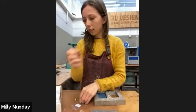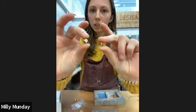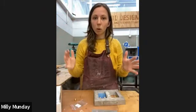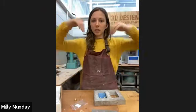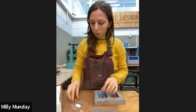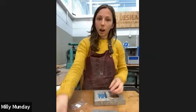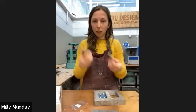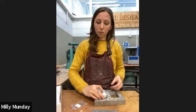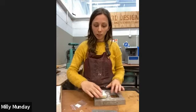And then what we've got is these mold lock formers, which we can just pop four of these in the corners, which helps when we're cooking the rubber, it will then automatically have its domes and recesses so that it locks into place. So we'd pop four of them in place. And then I would put the next three unpeeled layers on the top, so that we've got our vulcanized mold sandwich all in place.